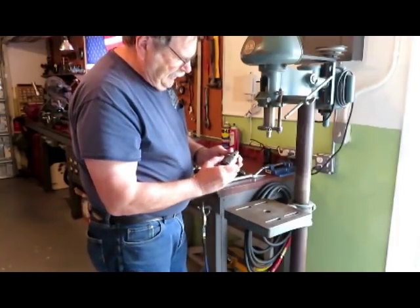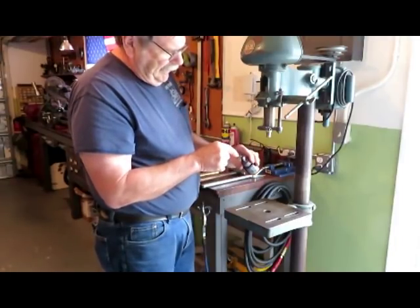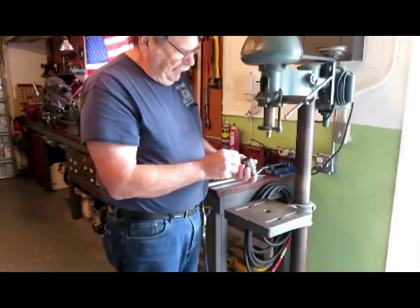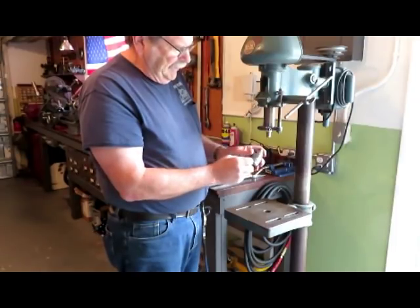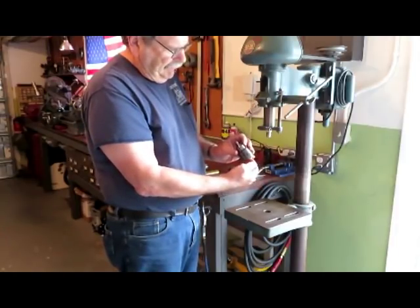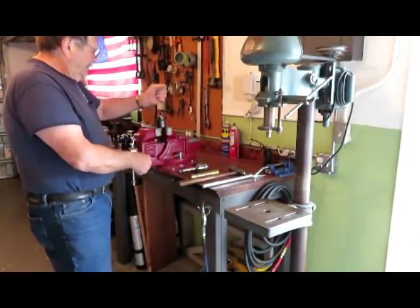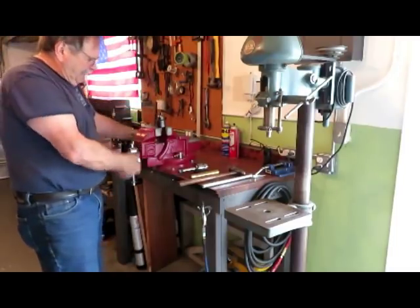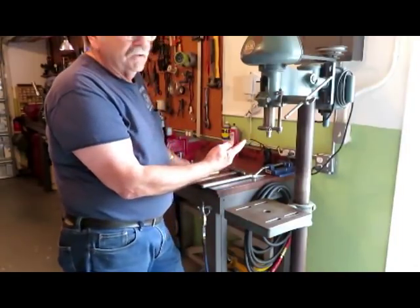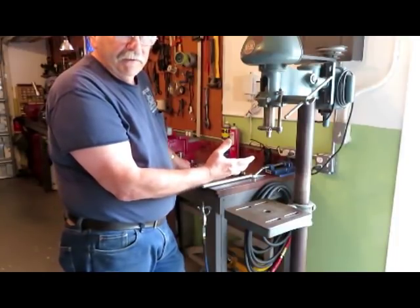In this case, there was no hole all the way through. So I drilled one, and it was a little bigger than 1/4 inch. And it drills very easy, and it was very thin. It was only like 1/8 inch, and it dropped down into a little void there between the end of the shaft and the rest of the chuck. So then I could put it in the vise here, and with a drift, I knocked the shaft out. Shaft was in perfect shape, put it back in, and determined that it was the most common taper for a Jacobs chuck, a 33 JT.